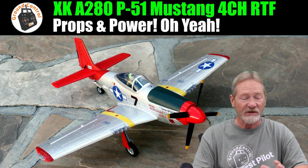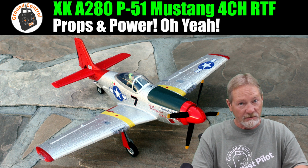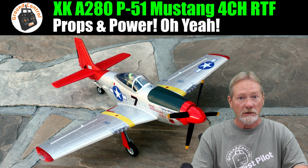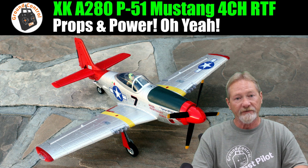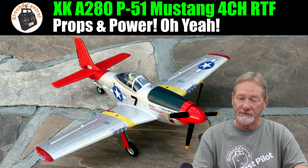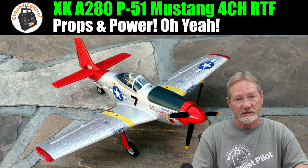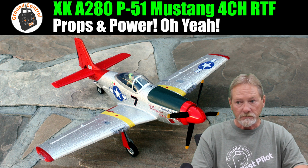It was a lot more efficient in the air than it was when I was holding it in a static position, running it up, you know, full throttle and 50% throttle with a fully charged LiPo. Looking at the amp draw that I was getting on the load meter, I did not expect those props to be as efficient in the air to get as much flight time as it looks like I'm going to get from it.